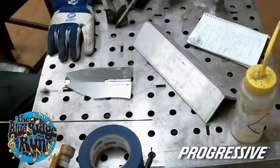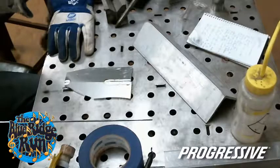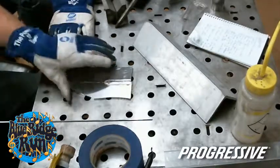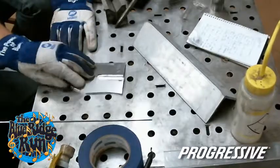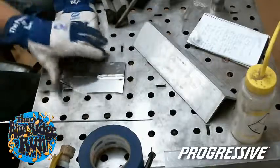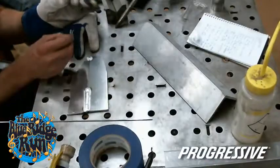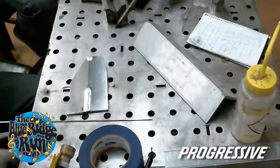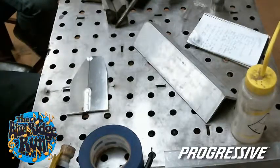And then once the frosty zone is big enough, you can actually start moving and dab your rod. So, like he's left-handed, so he's running the bead straight on. I'm right-handed. I like to run sideways. So just like we were talking about earlier, it's technique. No right or wrong way, really.